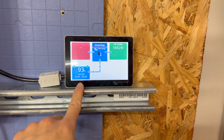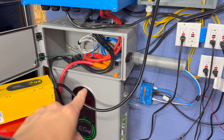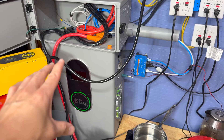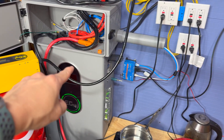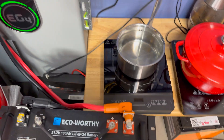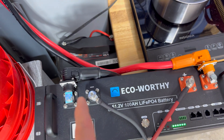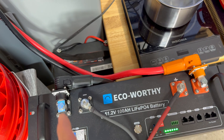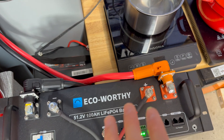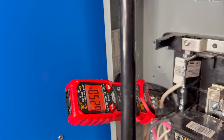The amp reading from this battery won't be totally accurate since the BMS is only connected to the EG4 wall-mount battery, not the EcoWorthy battery in parallel. As for how they're connected, we used the parallel kit with Anderson connectors bolted onto the bus bar - it was a shortcut since the connectors aren't the same size, but it works. So the inverter right now is loaded with 5,600 watts and about 5 amps on the neutral bus.